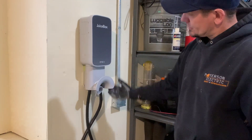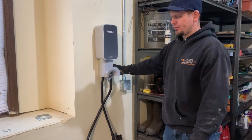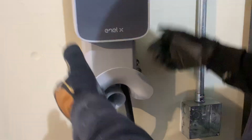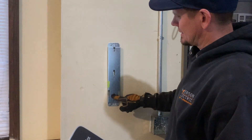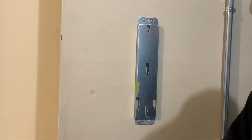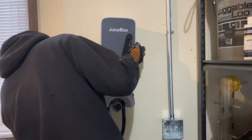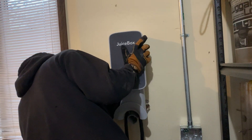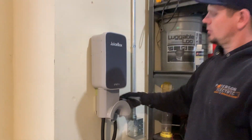This is the new JuiceBox design. It's got a sweep here. It does up to 40 amps, but it's going to be a 50 amp wire job. This unplugs — untwist here for the lock and pop this off. That's a little tricky to get popped off and on. Make sure your plate is like this, offset out. The instructions are horrible. I personally like the other JuiceBox design, but I think they went with this one so no one will steal it.